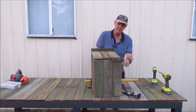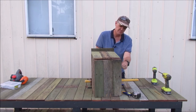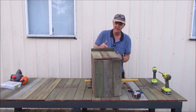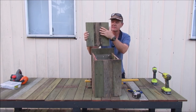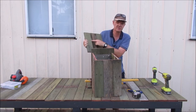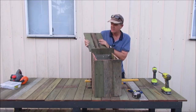Something I noticed is that on the sides there was a bit of a gap between each paling, which is obviously going to let rain and water in — that's not good. We might put something over the joins. I started clamping them together as I was screwing and that removed the gap, so on the top one it's basically sealed solid. When I remake the top I'm going to plane the ends for a really nice solid fit, then put a bit of glue in, clamp it, and screw it — that way the top will be watertight.